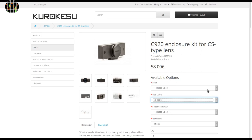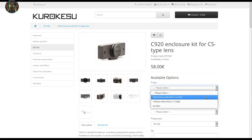During the conversion, you are going to remove the original lens assembly. This means you are not only losing the autofocus capability but also the original infrared filter. Without a new filter, the colours will be off and Kurokesu offers two options. The low-pass filter, which I selected, basically replaces the original filter and removes the infrared component. Or, you can convert the camera to an infrared version by using the high-pass filter instead.